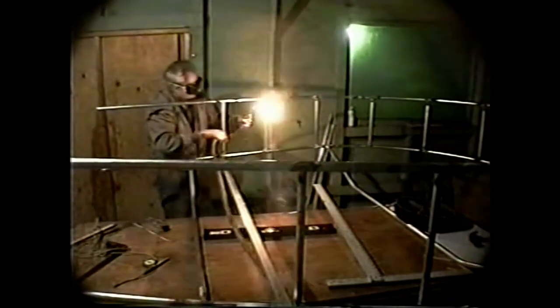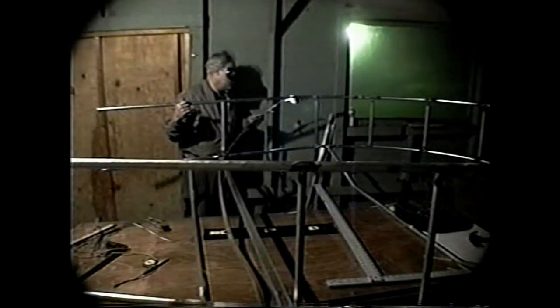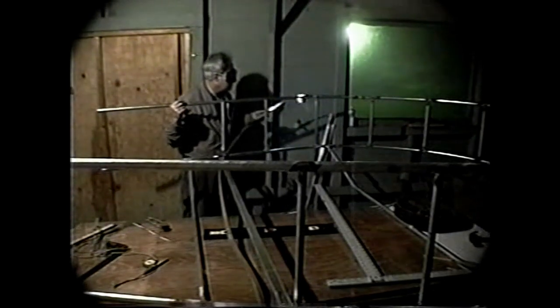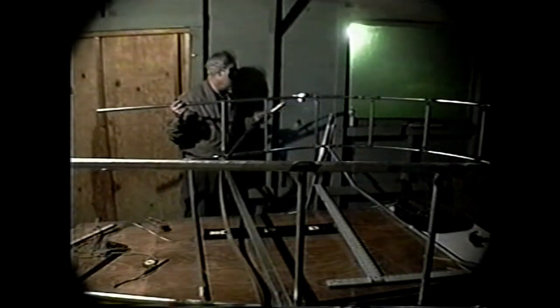You look along it, and you pour the heat through it. You look along it, and to get a smooth bend, you can heat about 1 inch of this tubing with this particular torch. And you can heat it in spots and push it, so you still get an apparent smooth curve. Since the force is low when you heat it, it will not bend the aft tube.